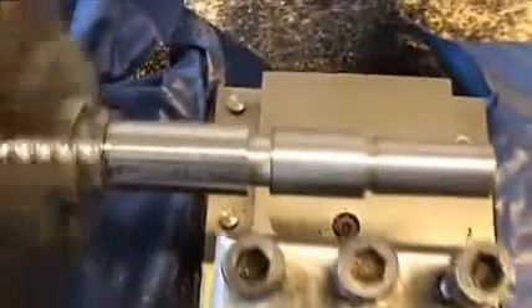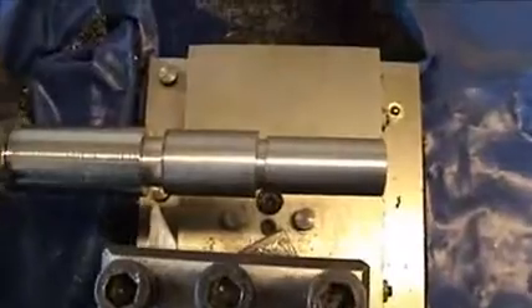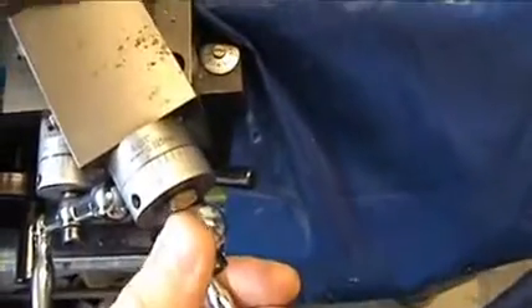Down here on the indicator, I'm going to choose 12 as the place to engage it every time. I'm going to get my half nuts half engaged. When the 12 comes around, engage it — and see the 12 stops. I'm looking at the cutting tool, and then I stop it in the undercut. Then back off on the cross slide, move the tool back to the first undercut, maybe cross slide in a bit more, and then repeat the process.